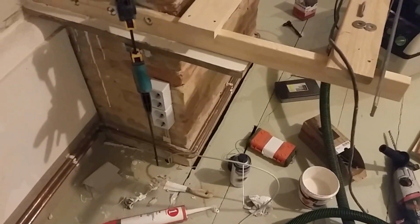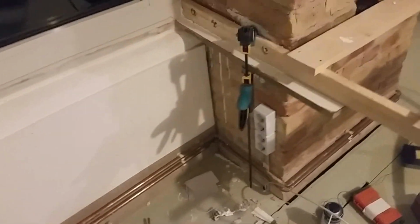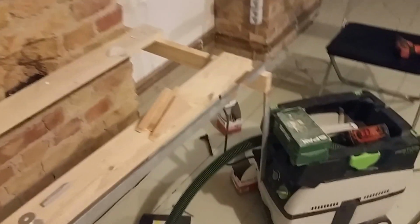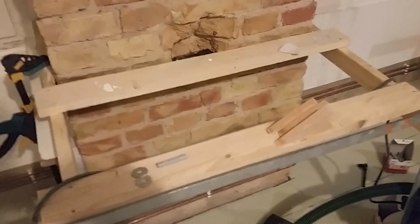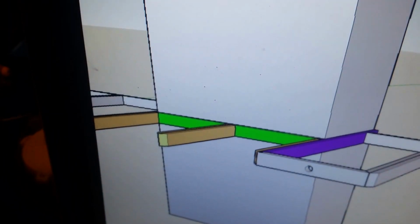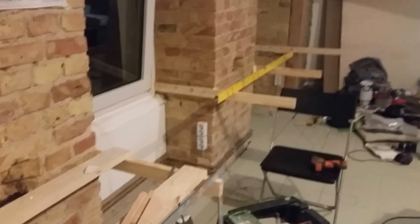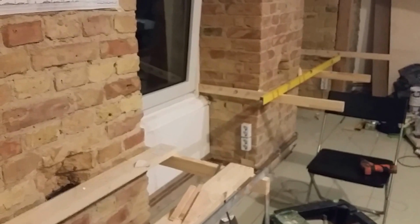But once we put that contact cement, it's called Ansitzbinder in Germany. It's really aggressive stuff actually, but once it's set, it's fine. That should give us a nice surface to work with, and to really distribute the pressure you get from the screws super tight. So then we put the green beam in the back, that one, and then screw the other ones from the back also, and then bolt them onto the wall, and then bolt them together with the ones just hugging this column, and that's pretty much it. It's gonna work just right.